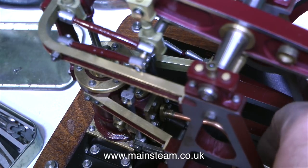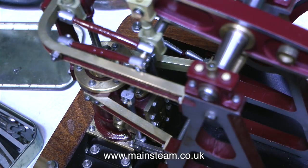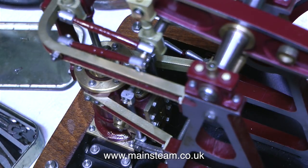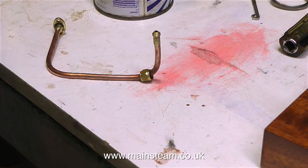What is really annoying is that I shouldn't have had to do this. The original pipe that I'm just removing was bent at the correct angle and stuck out of the side of the engine at the correct angle, but the steam union on the other end wasn't soldered in place — unbelievably, the union was just a push fit, probably with a bit of Loctite on the end of the pipe. So I unsoldered the flange from the original pipe and then resoldered the flange and a commercial steam union onto another piece of 5/32nds pipe, so it's silver soldered at both ends now.